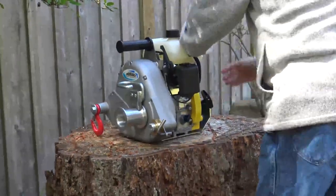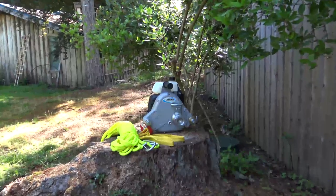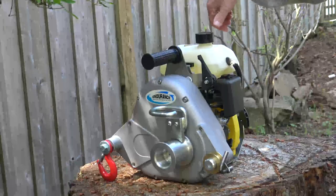A drum winch is generally capable of only using from 35 to 50 feet of cable and decreases in rated power by 10% for every wrap of cable on the drum.